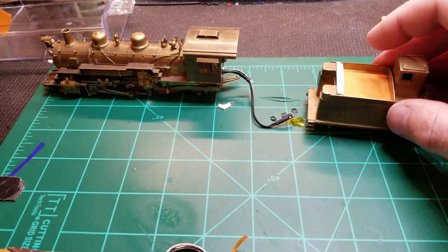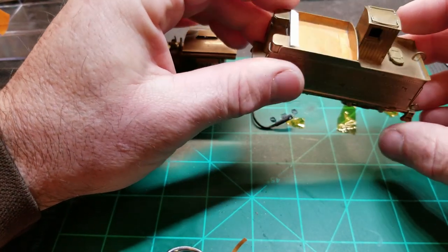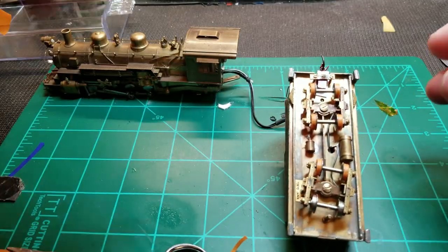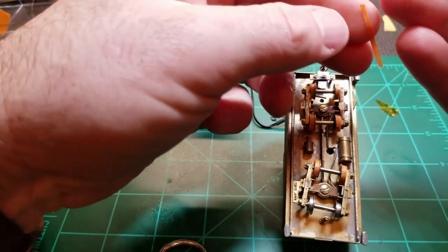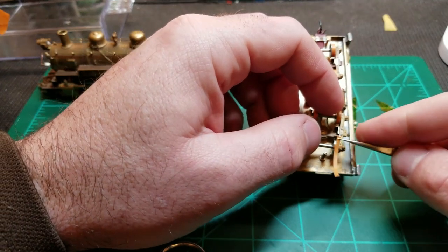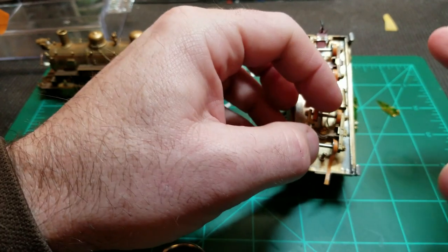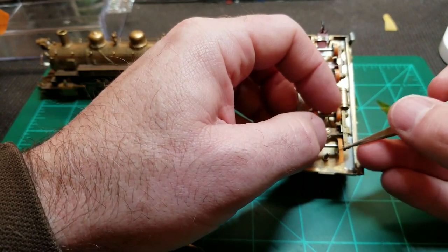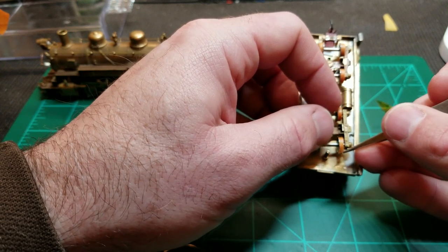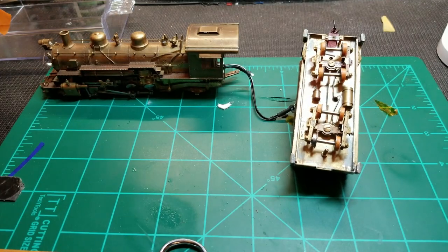Basically, in order to do that, just like painting these, you've got to totally disassemble them. So right now, as you see, I started just putting tape on the wheels. That way I'm not so worried about the blasting, and when I go to prime and paint it, it makes it a lot easier. I've done it the other way where you go back and clean it afterward, but it just seems to be a lot messier and never gets right. This is just a couple minutes extra.